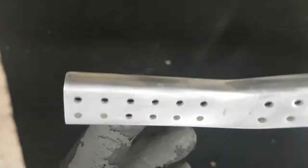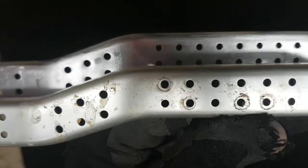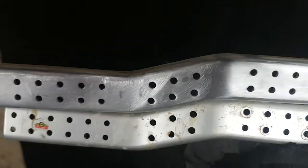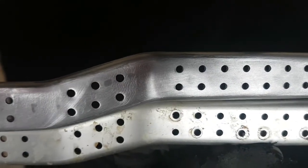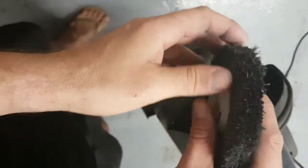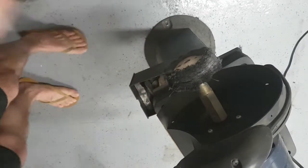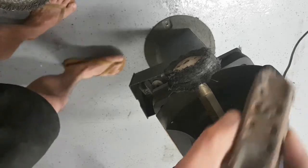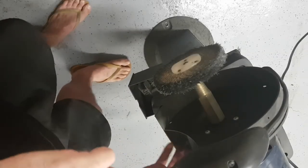So there is the piece after it's been sanded — see, all the coating has been removed. That's the comparison to the original, so you can see the difference there. Now I'm going to head over to the wheel. First I'm going to use the cutting-in wheel to get that metal really really smooth, and then second I'm going to use the polishing wheel. Brown first for the cut and then white for the finish.